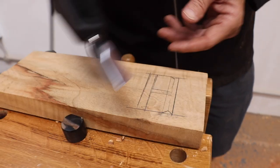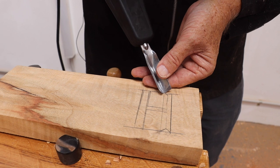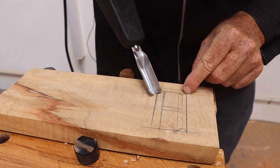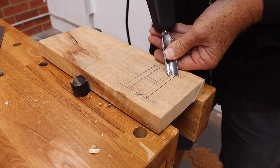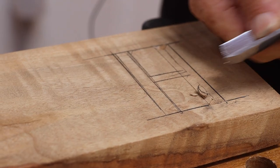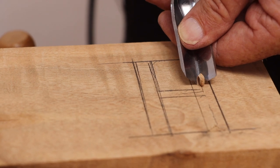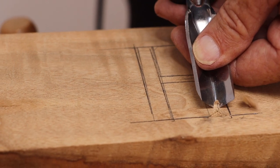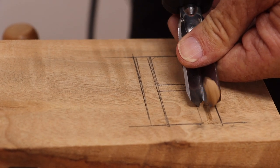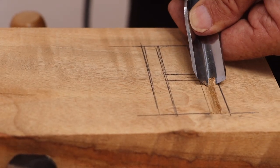To achieve that with the large chisel, you come in at an angle, and as you penetrate, watch the edge to make sure it's flush with the bottom. Then go down the center and do a shallow cut first - that becomes your guide. Go deeper and deeper, always pushing the center of the v-chisel into that groove so there's a nice sharp line on the bottom.